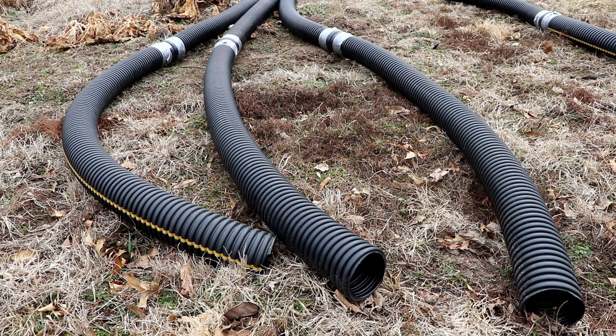I'm not going to grab the barrier fabric and show that to you — it comes on a 300-foot roll that's six feet wide. It's a three-mil barrier and all it does is prevent the soil from washing down into the rock. If the soil washes into the rock it can plug the whole thing up and then it won't move any air at all.